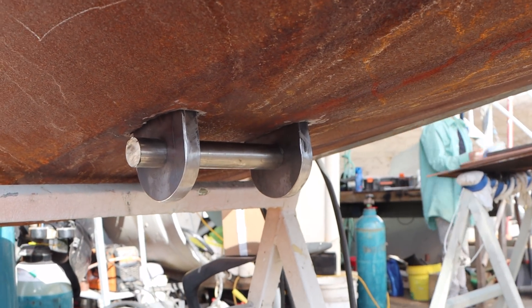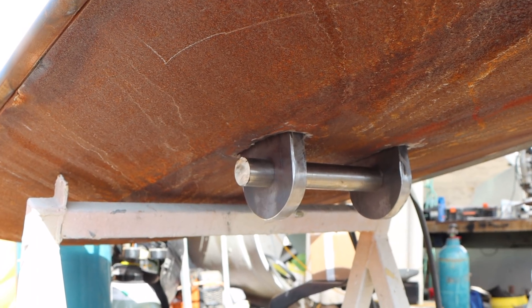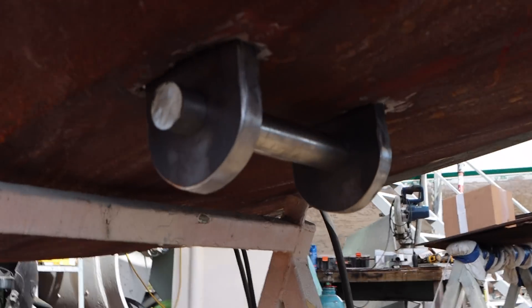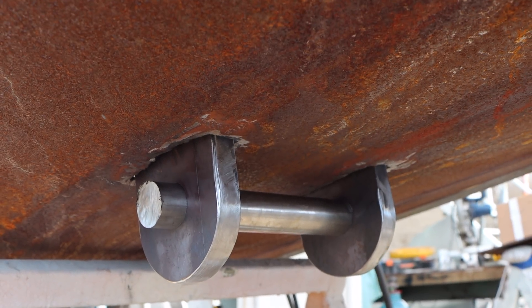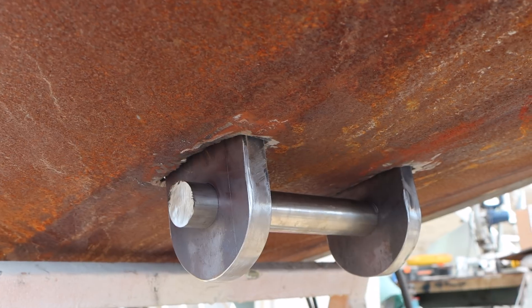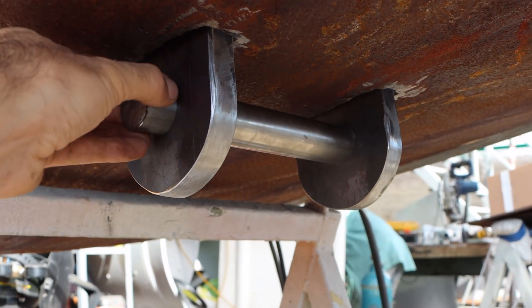That's the first sign of our pin arrangement. The plan is to create a pipe that we weld onto the end of the arm, and that pipe will slide through that inch-and-a-quarter stainless pin. When I weld this in, I need to make sure the pin is free the whole time — rather than do a big weld and warp the plate and jam the pin, I need to do a small weld, make sure the pin is spinning, then keep swapping over to ensure the best possible alignment. If that pin jams up it screws the whole process. I need to weld on one side and straightaway weld on the other side so it's even tension and doesn't pull left or right.